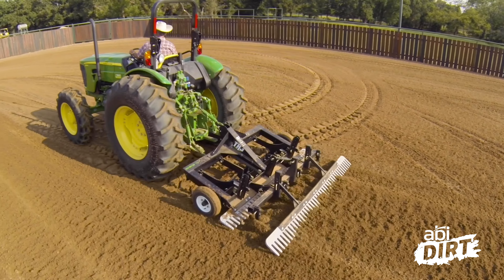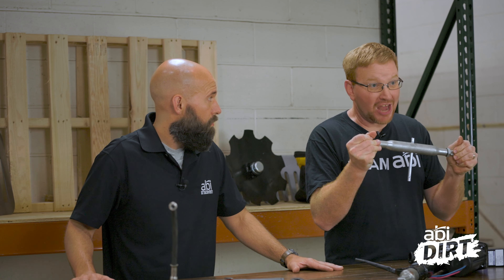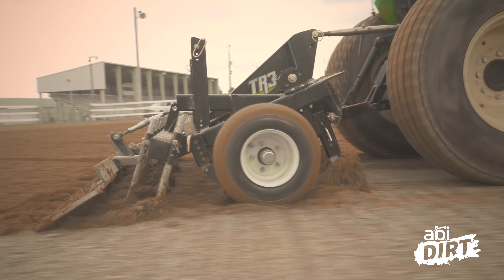Another pro tip on top links: this one has a locking nut. Sometimes they'll have a little tab sticking out. Lock it — especially if you're grading your gravel driveway or doing something like that, and this thing is sitting there chattering and rattling, it's gonna walk. You don't think it is, but it does actually slowly walk, and suddenly your adjustments aren't where you thought they were.